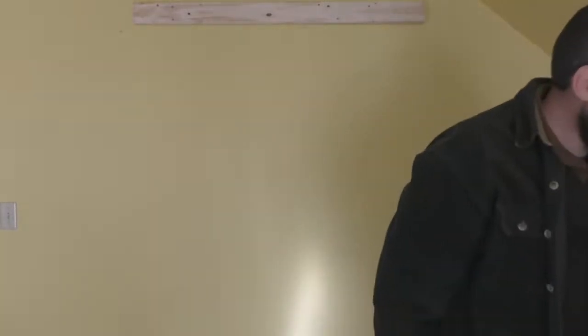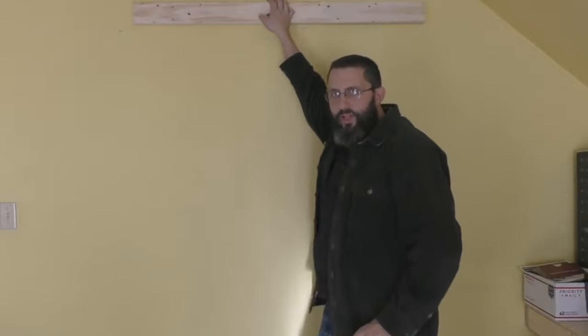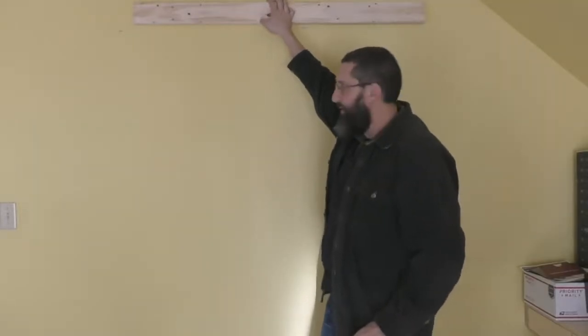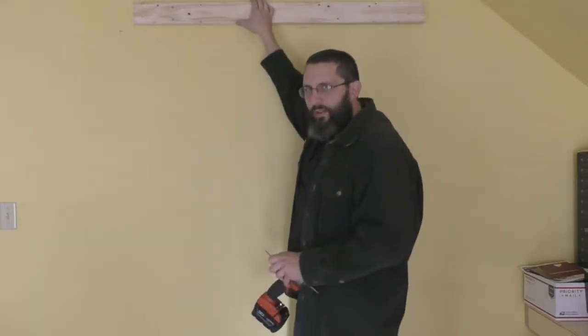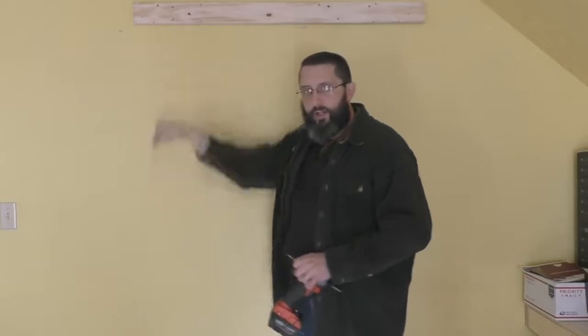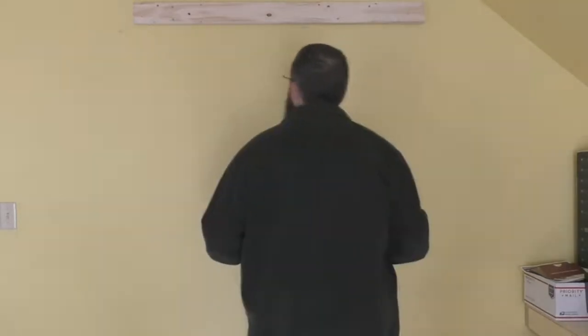And I'll just grab another one. And this really isn't even, you know, another thing you have to learn when you get into building things like this, is is it structural? Is it really going to have a lot of weight on it? And the answer is not really, because the boards I'm going to be putting on here are going to be angled down. So the vast majority of the weight from the board when I put it on here for the chalk talk thing is going to be pushing in towards the wall and down. So this isn't really going to have a whole lot of stress on it, because the boards will be screwed in there and going down to touch the ground, so they'll support that. So it's not really important to make this really, really strong up here.